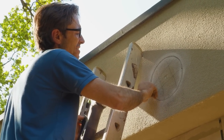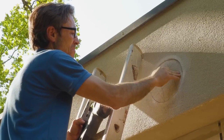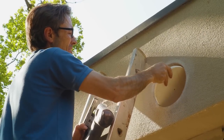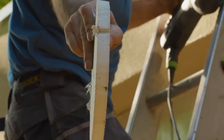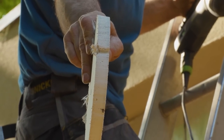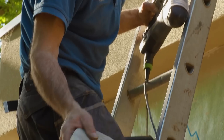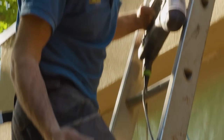In terms of time, it took me a couple of days to put all the plastic ducts through to the plenums — extract and supply — and it's taken me about four hours to do the spiral ducting, so it's not a very labor-intensive job at all. The blade got me 99% of the way around the render board; we had to finish it off by hand. You can see just how thick that board is — it's called Magply, a render board with a polymer render and mesh on top. Really good, tough stuff — but actually very light.